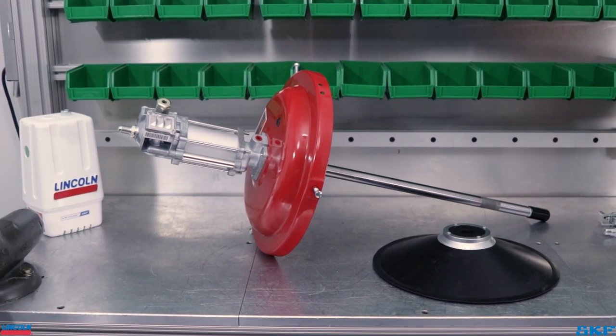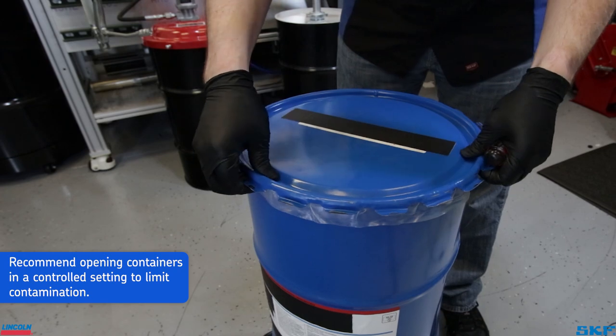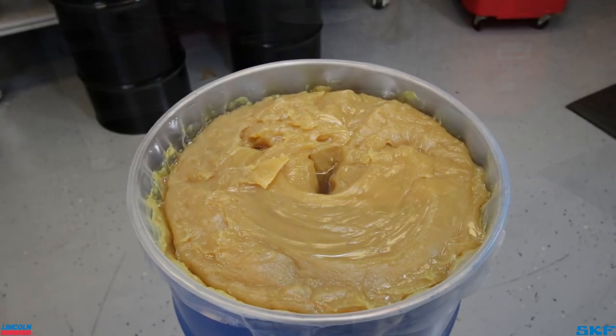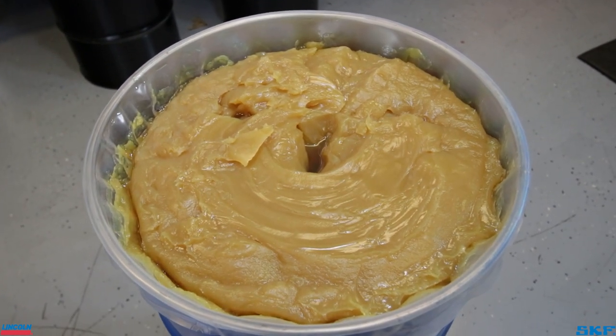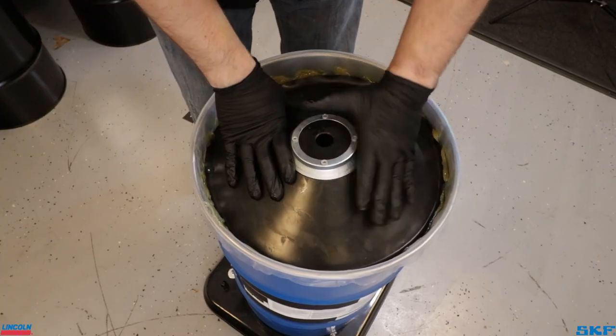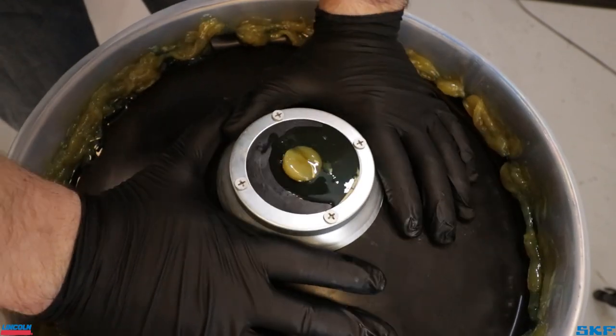The main elements of the kit are assembled. Let's install the pump onto the drum. Remove the top and open the inner liner as much as possible. Examine for any surface debris and remove any if found. If bits of dirt or plastic are sucked into the pump tube, they may cause a blockage and pump failure. Insert the follower as shown, massaging it into place until the air is pushed out from underneath. Stop when the lubricant begins pushing into the follower center port.